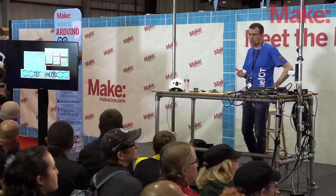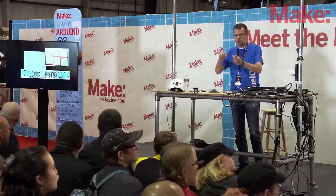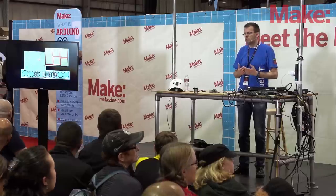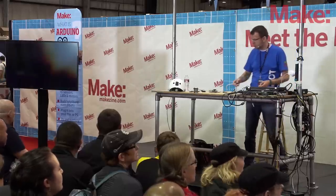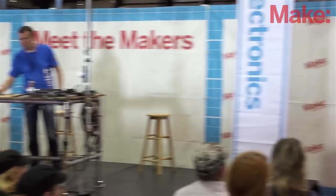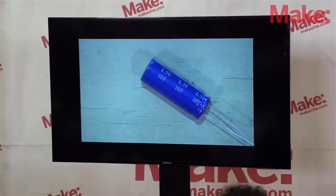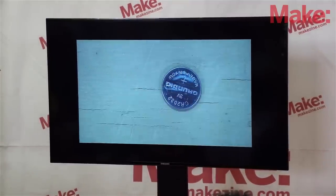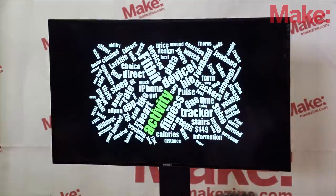Then we did some work in the lab and said we might need to build a wristband. You see the first design study we made — how the PCB board could fit to a wristband, how we attach batteries. We built the schematics and had a lot of thinking around whether it should be a coin cell or something like a supercap, which delivers a lot of current and can recharge quickly. We decided to go with a simple coin cell in the first stage. We also thought about LiPos and decided that might not be a good starting point for a wearable open hardware project.